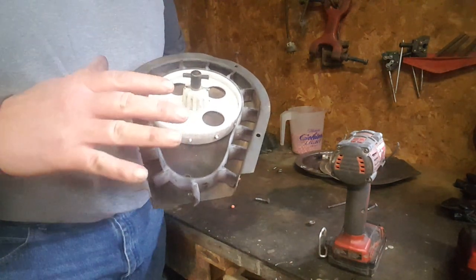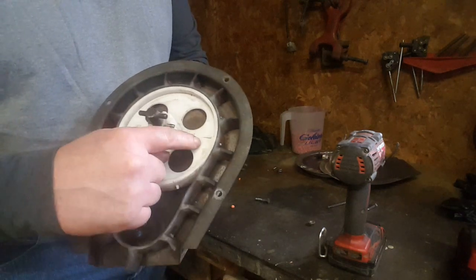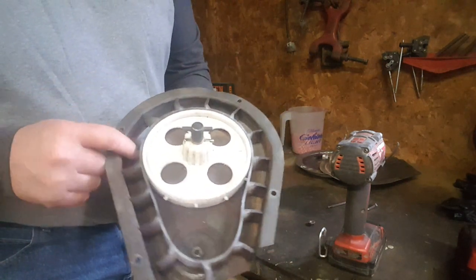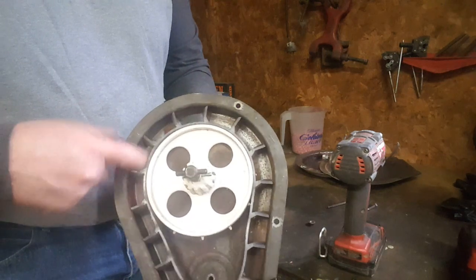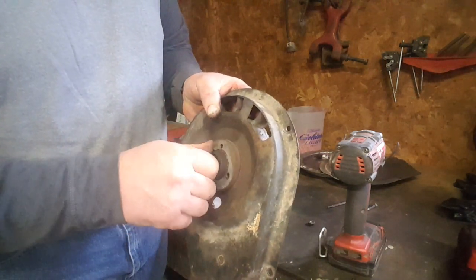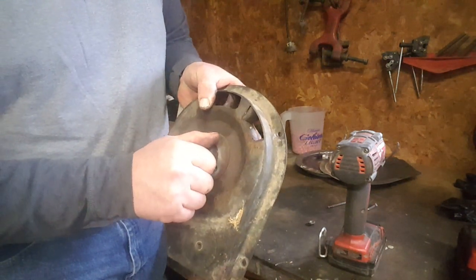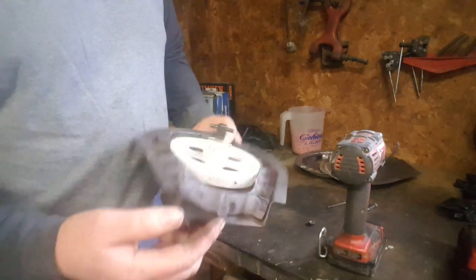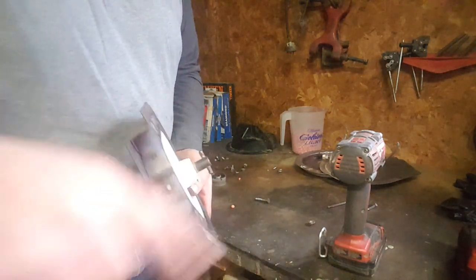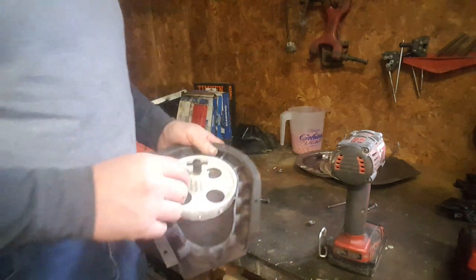For the belt - to finish on the wheel - the Precision wheel is nice. They give an indicator for how the paddle is supposed to go and the direction it's supposed to turn. Between the wheel and the belt, they alter the timing a little bit versus the John Deere, which makes it more true. The John Deere paddles were more off-center in the window, so there was always a little chance to get a skip or double. The Precision ones center it better. The Precision belt is cupped to get that seed down the center, so it doesn't drop along an edge and bounce down the seed tube. It really is a big improvement.